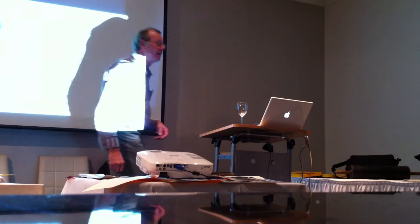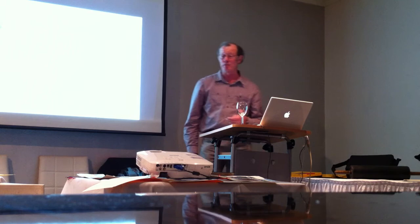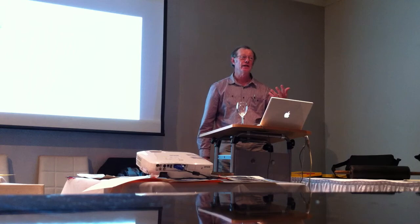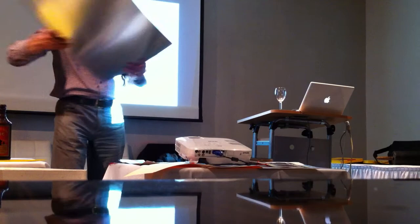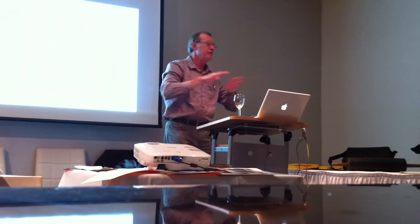I think it was 1986 we went to offset printing plates. I don't know if you're familiar with offset, I'll touch on it very briefly. Offset printing is printing off a flat plate. It's not a raised image. There's a sample one there. That's an offset printing plate, like a grained aluminium, which holds a film of moisture easily.